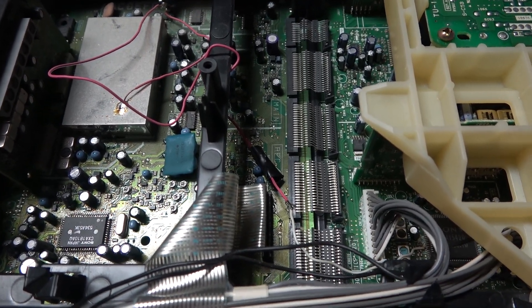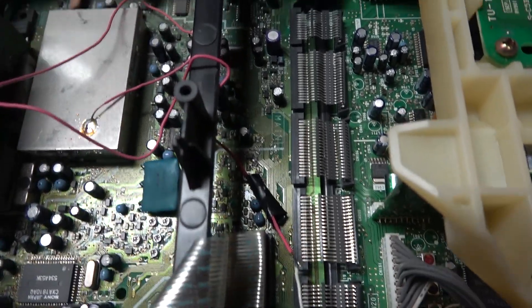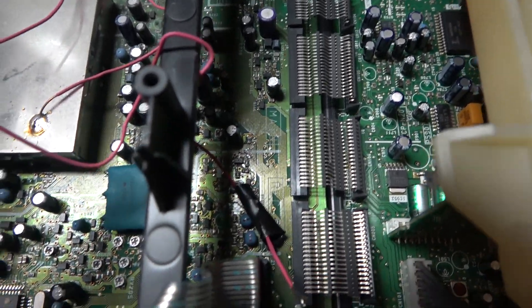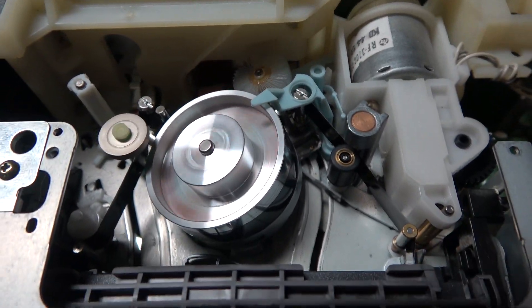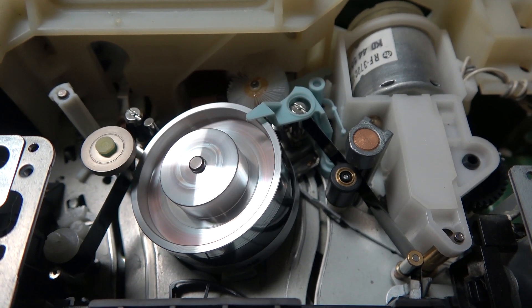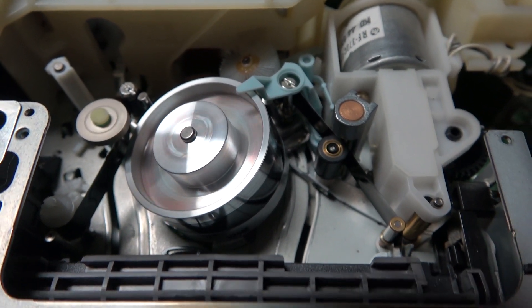You might get a bit of a buzz, but a little buzz with the audio is better than no audio at all. When the switch is off it mutes as normal; when it's on it grounds out the mute pin and allows me to get a recording. It also aids in setting up the alignment, because I can hear the sound getting clearer as I approach the correct alignment.